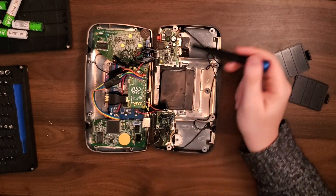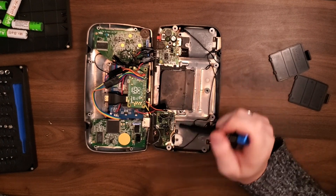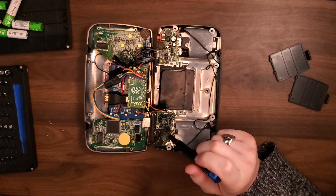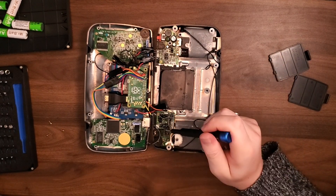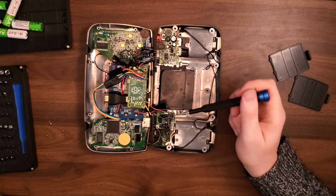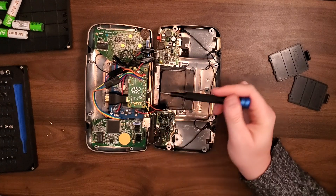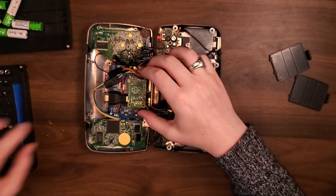On the opposite side here we do have the sound board. All I had to do to get it working was recap it, which is a fairly standard practice for the Sega Game Gear — a lot of these have sound issues, you swap out all the caps and it magically works. After that fix it's as simple as running power, left and right audio, and ground through to this board, and then it works just fine, pulling everything from the Pi to get the sound. We just wired in to the sound hat that we put in.